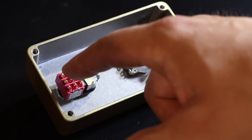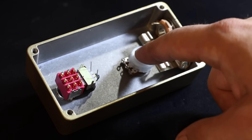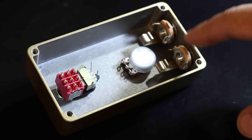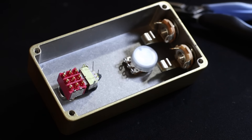The signal is going to flow down into the switch, out from the switch, through the transformer, into the pot, from the pot back into the switch, and then it will be switched back out to the output jack. I'll wire this all up and then we'll come back and I'll show you what I did.